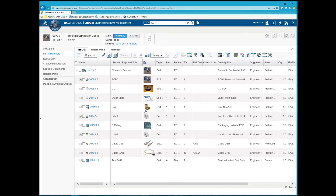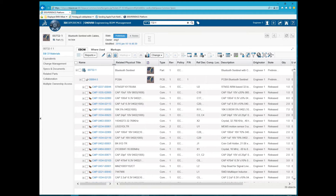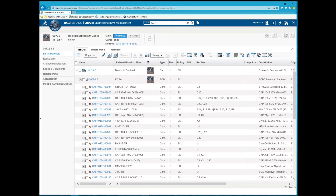A PCBA, software and other things belonging to the sellable part. The PCBA in turn consists of all the components in the design. The names come from the Altium Vault in this case and here we can see the designators. Notice the 10K resistor R9 — it will be changed later, and down here we have our PCBA.